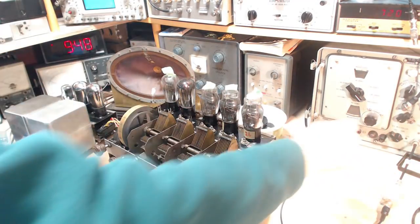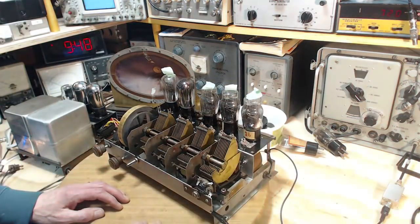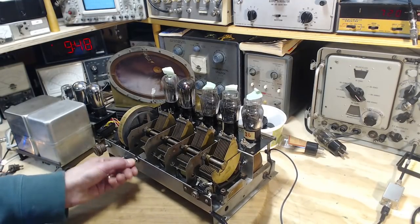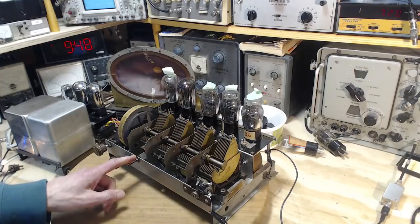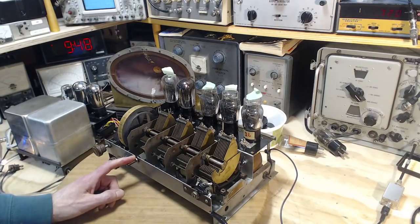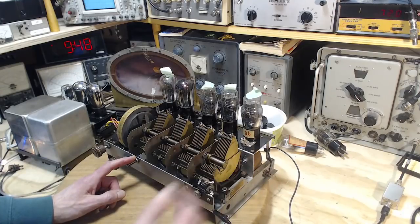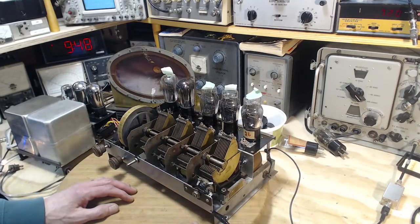Can't say I really hear any distortion. Let's try it at 400 hertz. I don't hear any distortion in the signal. This is turned up full. We just whacked in there a really strong signal, much stronger than any radio signal it's going to get, at least from this kind of antenna. A loop antenna may provide that kind of signal. Wow, doesn't seem to be any problem.